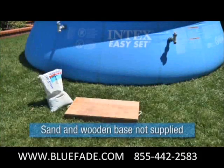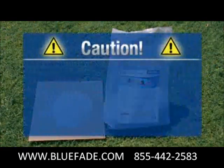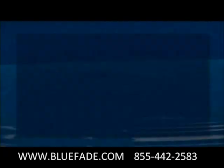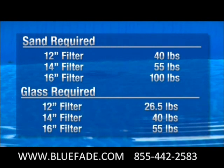You will need number 20 silica sand or glass media for your filter. Check the chart for the quantity required for your size filter pump and the filter media you wish to use. Do not use synthetic sand.